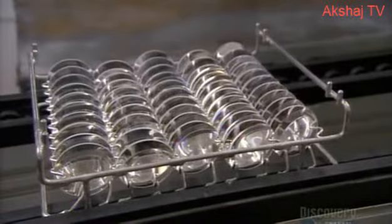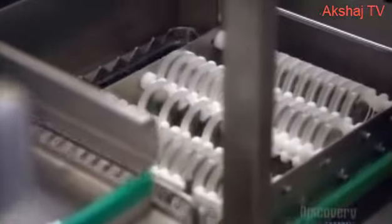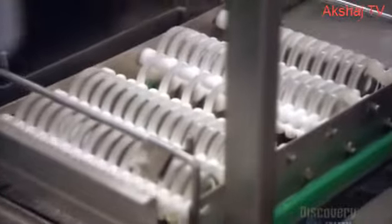Now for the objectives. These curved lenses have undergone the same grinding and polishing steps as the prisms. Now they go through a nine-stage computer-guided cleaning process. After inspecting the lenses, a technician glues two together. A double lens limits a type of distortion that causes fringes of color to appear around the image.